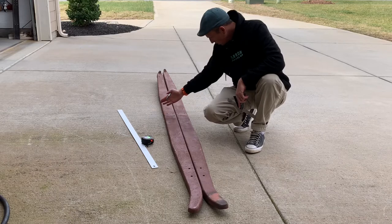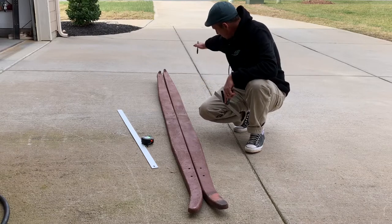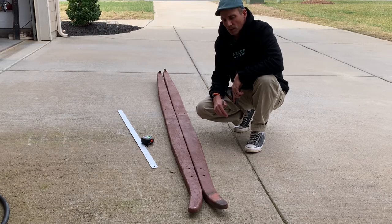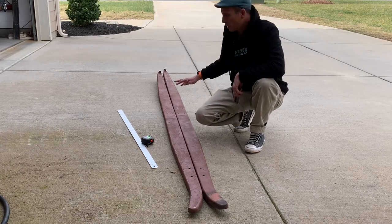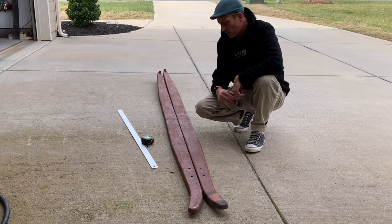But back to the center cross section, everything seemed to be good and square. And then as you went to the back, the driver's side frame rail seemed to tweak out, and at the longest distance from basically the front cross member to the rear cross member, I was about a quarter inch out. So I want to fix that.